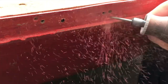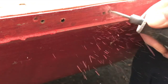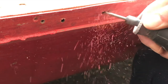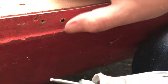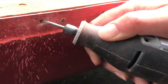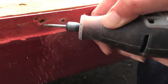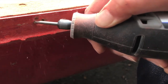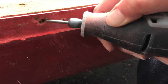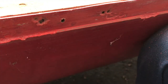You just saw that little piece, which may be a quarter inch, but look how much I actually had to take out to clear it so that it was ready to be patched — quite a lot of work. And it wasn't just that ledge; it was this piece here between the fiberglass hull, between the in-wale and the gunnel. There were some really old nails or screws, so those were taken out as well, and all of these were patched. The only holes I left were the original rivet holes. She's going to be strong now.